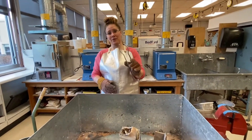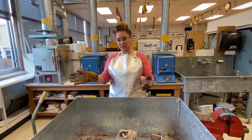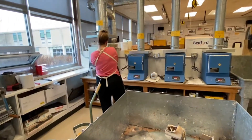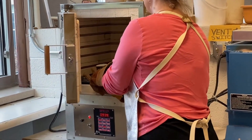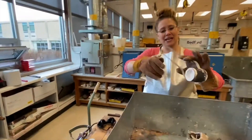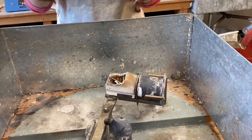I'm going to put my gloves on because I need to grab the flask from the kiln. The teacher is the only one over here. Students need to be on the side of the kiln that's away from the windows. I'm going to open the kiln — it is 979 degrees in there right now. I'm going to take my flask and set it in the centrifuge, making sure the crucible is pushed right up against there.